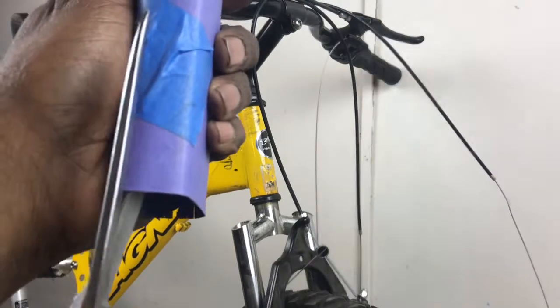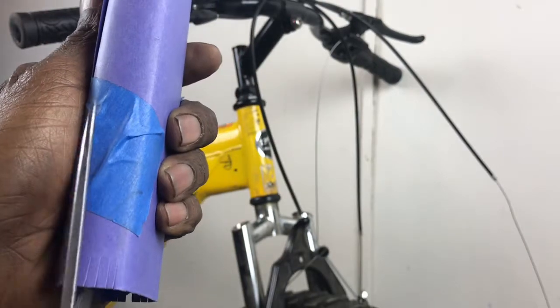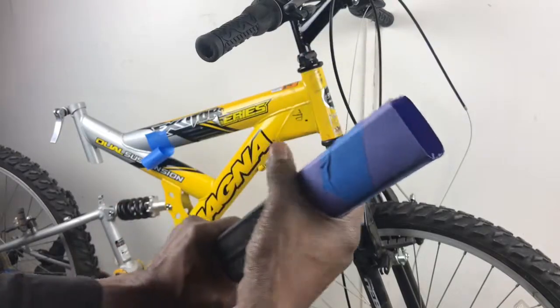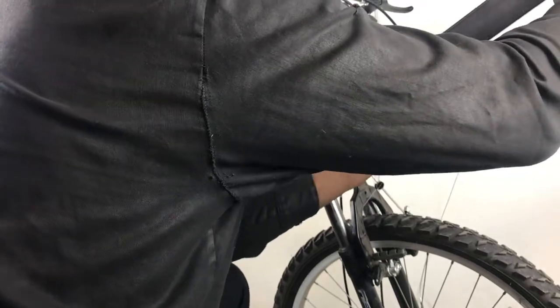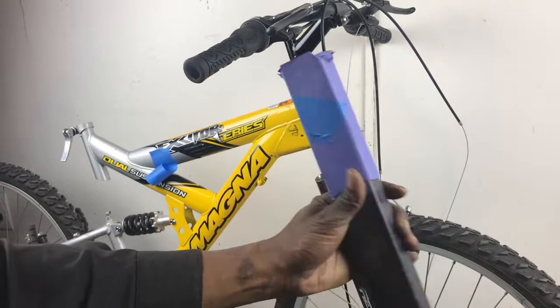On the back side we'll cut some release cuts too — that's going to allow it to flex more. We slide this on and give it some space. Now that we have our tube slipped on with our indentations cut in, you take it and fit your tube up against the tube you're trying to fit. Slide it forward, and that gives you an idea of how much you need angle-wise, on the back side also.